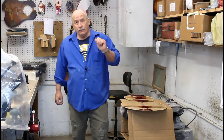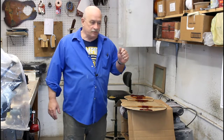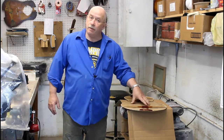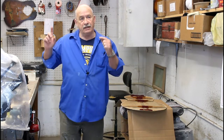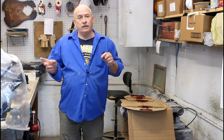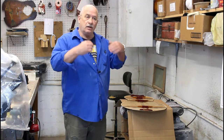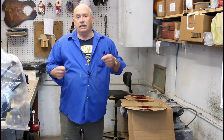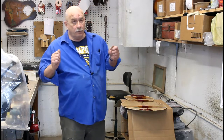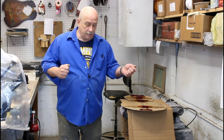As many of you already know, we are sort of in between batches of mandolins right now, working on some repair work. Our number one job this week is that A-style mandolin that we had to replace the neck in. It's already put in, all the binding is done, the pearl inlay has been done, and now all we need to do is get it finish-prepped, get it stained, and get some clear coats put on it.